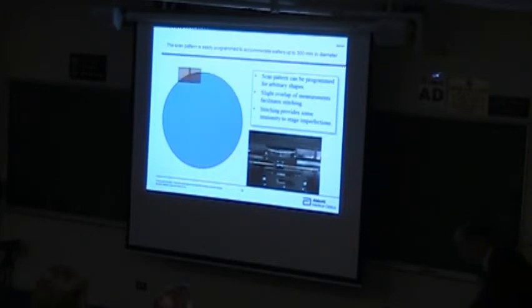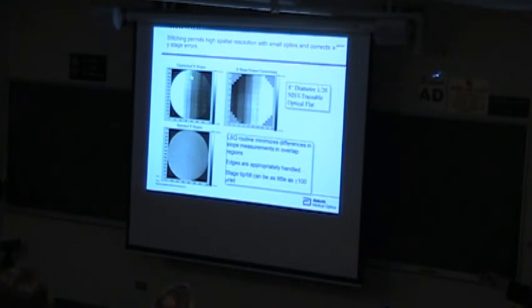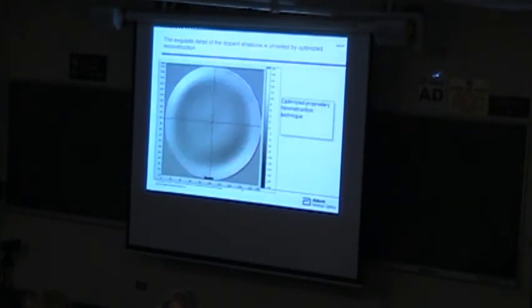And in fact, I think the next one shows you these unstitched slopes. This is just the X direction. And you can see there's all kinds of little patchwork of errors here. And so by looking at those overlaps, we can calculate a frame correction. That's this term here. And when we apply that correction, then we can almost completely remove any of those stage errors. The advantage of the Shack-Hartmann here is that we measure the slopes, and so we're insensitive to just piston changes, so we're insensitive to height variations, but we measure the thing that is most likely to be a problem, which is little tip and tilt variations as we move along. And so that turns out to be a very good technique. And then when you apply that now in 2 dimensions and put that into a full reconstructor, this is actually a 200 millimeter wafer.